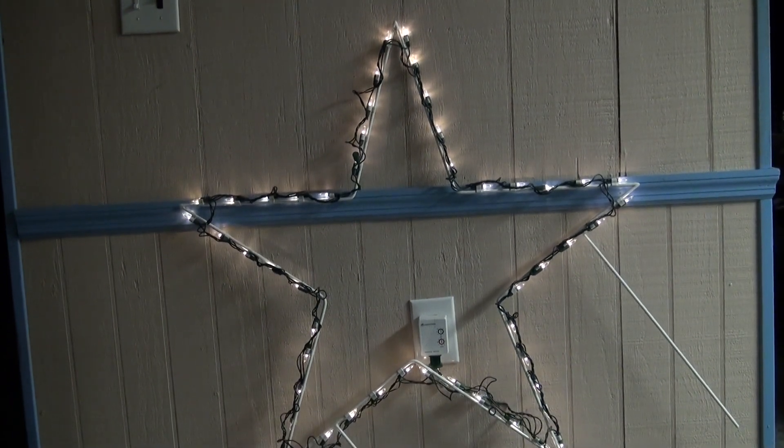Hi folks, Paul Carroll here. Like a lot of you, many people out there have LED lights — they're moving over to them 100%, getting rid of all their incandescents and plugging in their houses with or without Light-O-Rama control. When they light their entire house, even when they turn the lights off, the LEDs are still partially energized — about 2% — giving that residual radiant glow. The way to fix it is called a snubber.